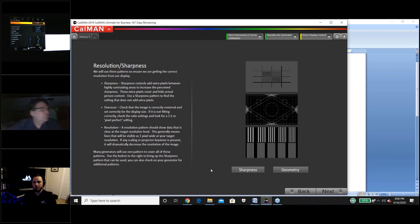Now on the JVC, when you go to do HDR, is there a dedicated mode for HDR, or do you still pick a user mode? You can pick a user mode. The problem with HDR on this year's model is that when it gets an HDR10 signal, it jumps to gamma D. Yep, which inherently is not the best choice.